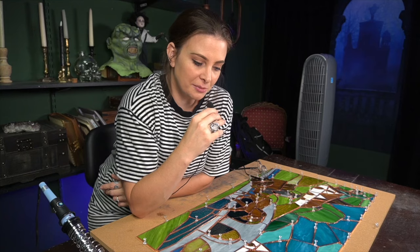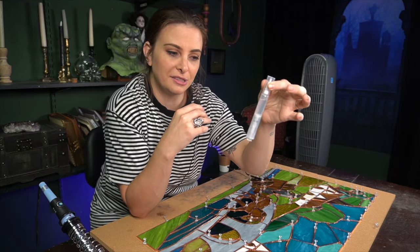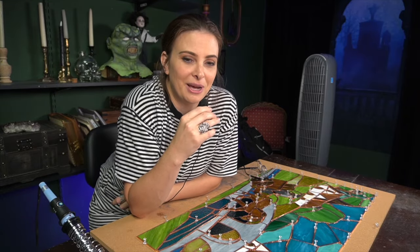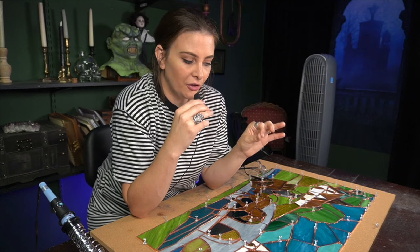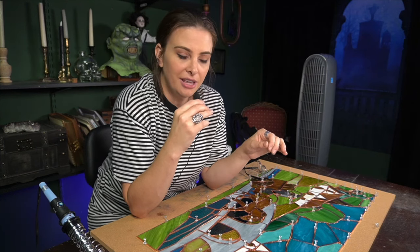Okay, so the first step in soldering is to use some flux, which I have in this little flux pen. I got safety flux so that it doesn't smoke as much and send off too many bad fumes. Regardless, I have a respirator and some kind of ventilation here. So I need to flux all of the joints, or where the lines come together.